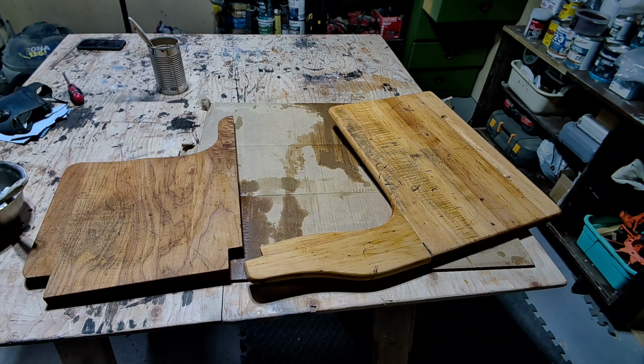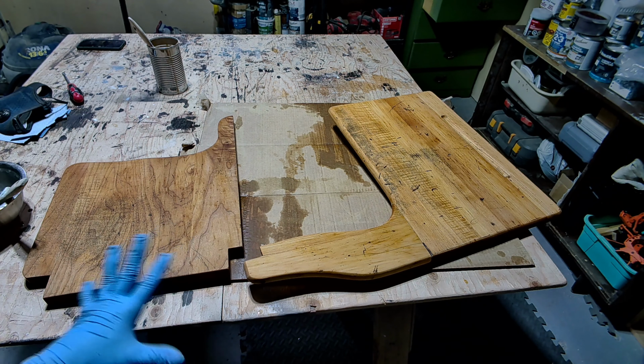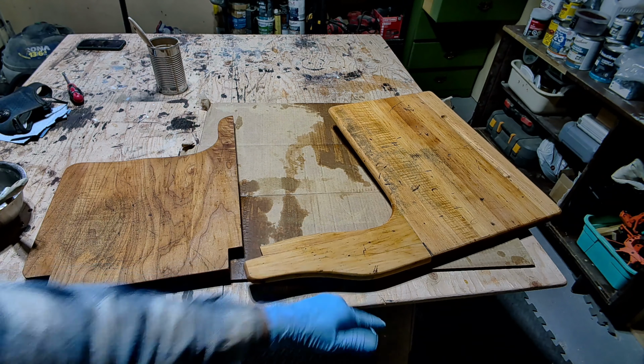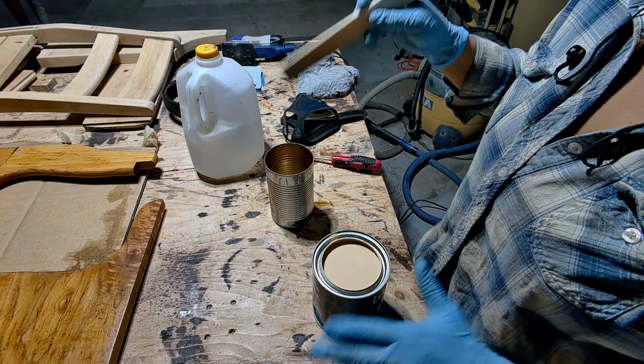Okay, I'm really happy with how this bleached up. I will let all of this dry now, and then I will come back with a 120 grit, a 150, and a 180 to finish in preparation for the whitewash. And then once all of that is done, I will start to put it back together, and then I can top coat it. And then this piece is done and I can move on to the next for the summer promo projects. So all the sanding is done.